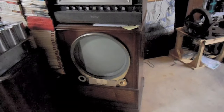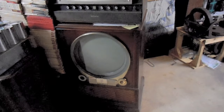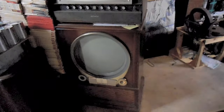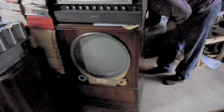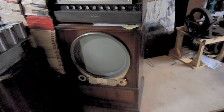Let's see if I got the ion trap crudely right on my first try. Okay, so the ion trap definitely isn't right. Need no audio. Stop talking back and let me adjust the ion trap. Do we have high voltage? We somehow don't. That's gonna make this less fun. Okay, we got 11 kilovolts of high voltage. Should be enough to run one of those tubes.